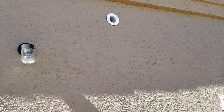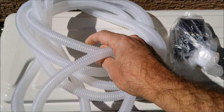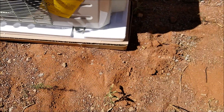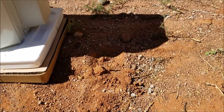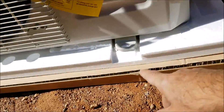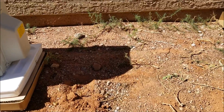I got the inside bracket up and the hole drilled through the wall — there's the three and a half inch hole with my disconnect over here. Here's the outside condensing unit inside its box. It comes with a water line, condensing water line, and some little feet if needed. The next step is to mount it on something solid and flat. You can pour a slab, or there are pre-bought pads for about $40 on Amazon. I'm going to just use some bricks, level them up, and set the unit on top.